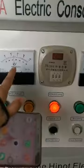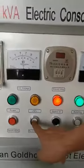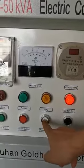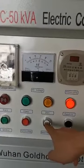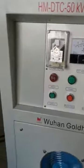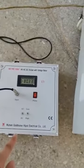And when it arrives at 80% of rated voltage, we can choose electric stop. And we can use the manual boosting step by step. 80 kV. Now we will find that our HV meter has already arrived at 80 kV.